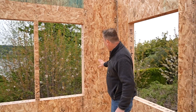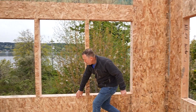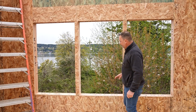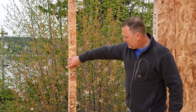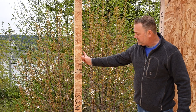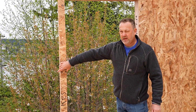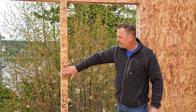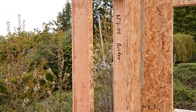This particular wall has two full height panels, then three window fillers, and they're connected together with mullions. These mullions are solid lumber. What they did here is put in the solid lumber, which acts as the connection between the two panels. Then to make everything plane out correctly, they've surfaced it with a sheet of OSB on both sides, just like the SIP panel itself.